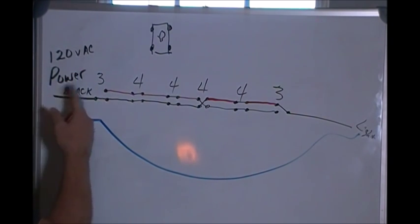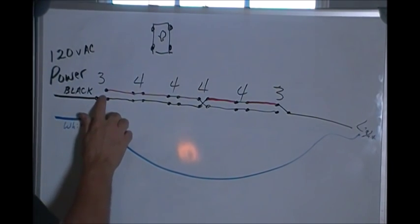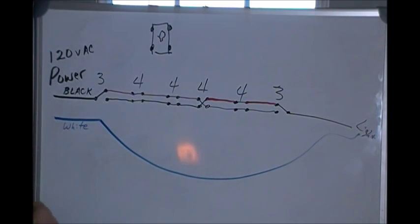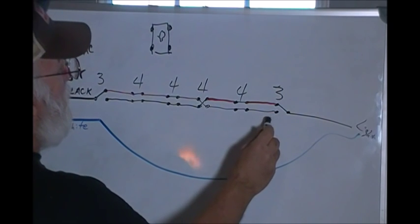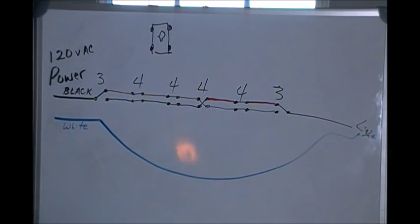It's real easy to see right here. If I flip it that way, then obviously that light's not going to work because I flipped the switch. But let's just do it real quick. We'll walk right through all of them. We'll take just a second. I flip my switch to where it's making contact there. And so we're running along here, and we go down and all the way across it. Oh, I do not have a connection here. My light is not on.